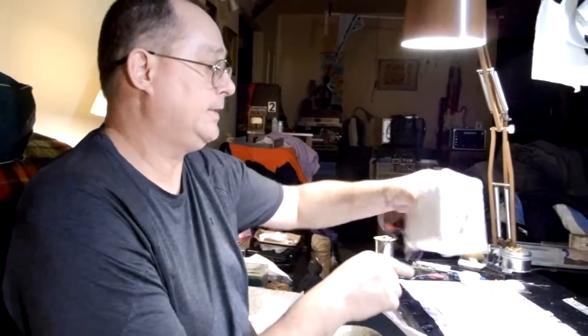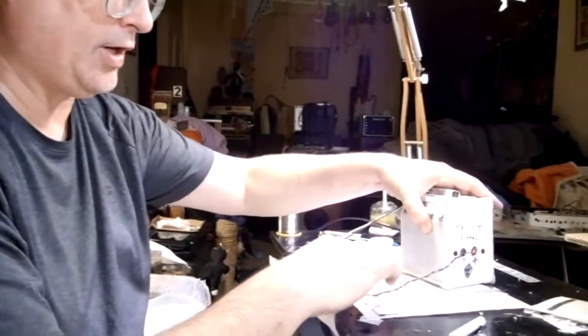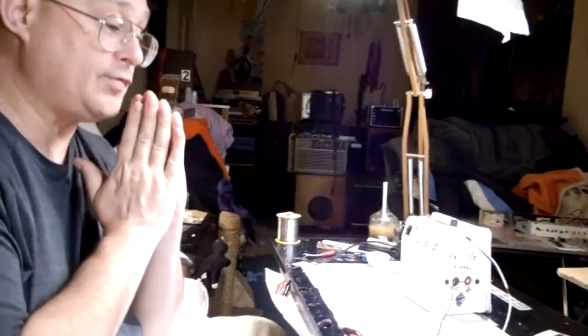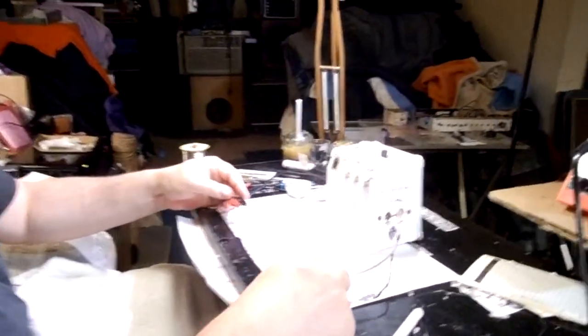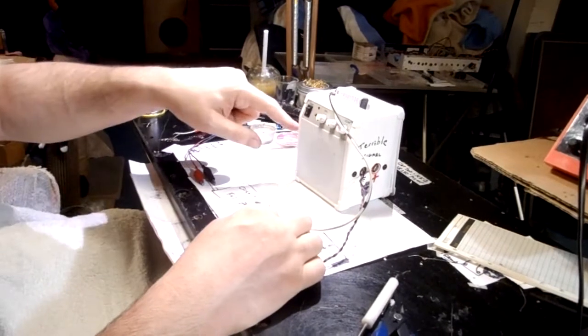This is the test-a-matron 7800. You put your iPod up here and then run a cable down. It's an amplified speaker. I put in a test signal generator, so if you built a guitar pedal circuit and you're at the stage where you just finished it and you need to test it out, this is what you would use. You wouldn't use a guitar, because if there's a problem and you're going to need to spend some time servicing it, having to keep playing a guitar all the time is not a good idea. So this has everything you need. There's a power supply. This signal output is a beep that connects up here on the input of your circuit, and then the output here goes into the amp, bypassing this.